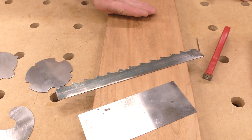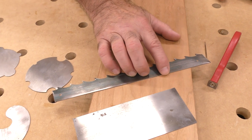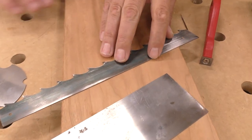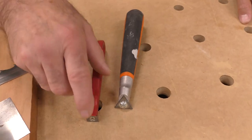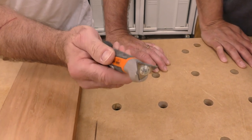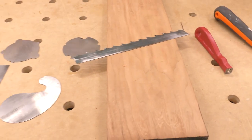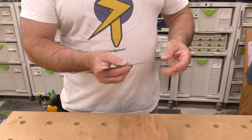For simplicity, this here is hardened steel — it'll hold a burr. And if you feel right here, I have a burr on there. We have cabinet scrapers for different radiuses. These are carbide scrapers. I love this one for getting inside corners. This one here is how I scrape down staircases. These are replaceable. A friend of mine in Austin — his dad taught him to scrape finishes with a piece of glass. I want to keep it simple and show you how certain things in the shop you can make if it's hardened steel.